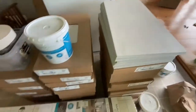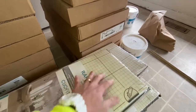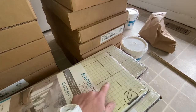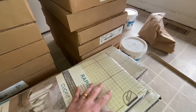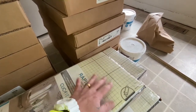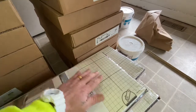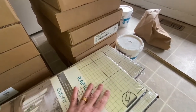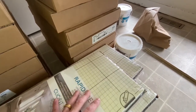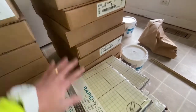You're also going to need the rapid prep — this is your underlayment. Basically like you would put Ditra down or a slip sheet for LVP, this does about five different things: stops noise, stops moisture, helps with unevenness in the floor, acts as a slip guard, but allows expansion and contraction. It's got great grid lines so you can lay it out. You have to have this rapid prep for the Revo line.